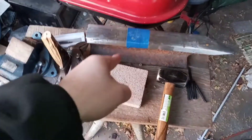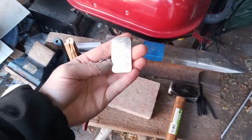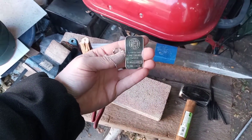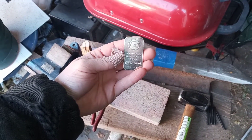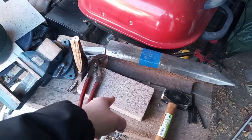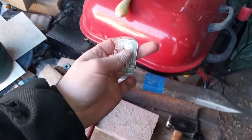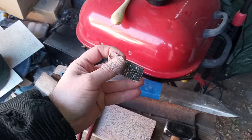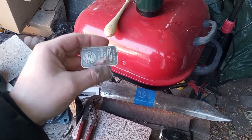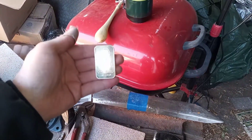Alright adventurers, today we're back out at the anvil and we're going to make some ring stock. I'm too broke right now to order the good stuff online and I also don't have a rolling mill. So we're going to take this one ounce of fine silver from Englehard, which is a pretty neat little bar. We're going to heat it up, use that hammer, and flatten it out just enough to where the detail and the ridge are gone, so it looks nice and smooth and I can make ring bands and backing plate out of it.